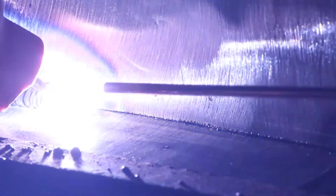Now here you see that I'm dabbing the wire and then I pull the wire out so I can see the puddle. I can see it melt down all the way into the joint. I recommend doing it this way while learning. I don't normally do it this way now, but I'm showing you how to do it so you know for sure that you're breaking it down all the way to the joint. You could crank the heat up and just lay it in there, but I recommend doing it this way while you're learning because you learn so much by pulling the wire out and actually seeing what your puddle is doing.